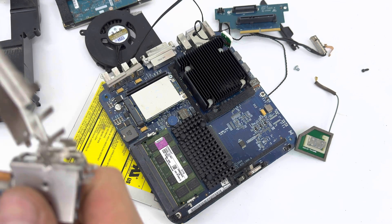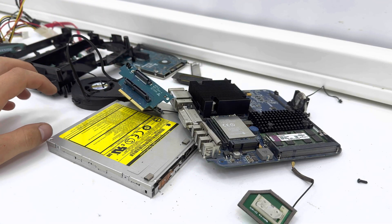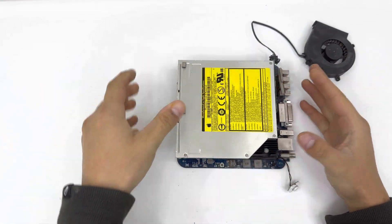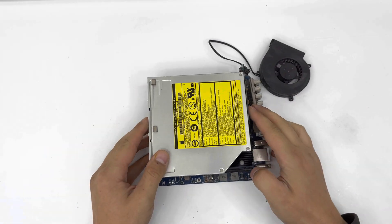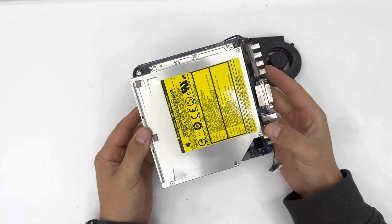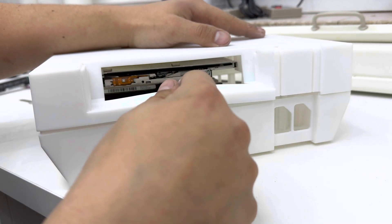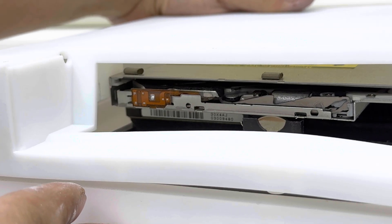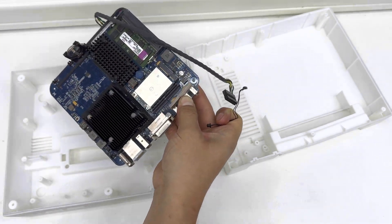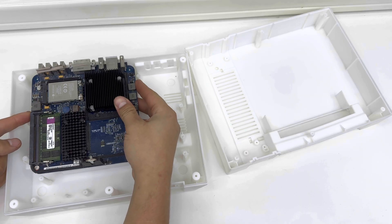After a while I had things stripped down to bare components: the motherboard, fan, hard drive, and optical drive, along with sensors and antennas. Instead of attaching those drives to a standard SATA connector, there's a custom interconnect board which connects to the HDD, slimline IDE optical drive, and the audio in and out ports — because Apple. I was really in luck though, because that optical drive was the exact same width as the opening slot for the game cartridges, and in exactly the right position too — within like a millimeter, like it was meant to be. The board was also smaller than the ASRock one, giving me more room to work with, and the RAM sat flush, so overall it turned out to be a better suited option.